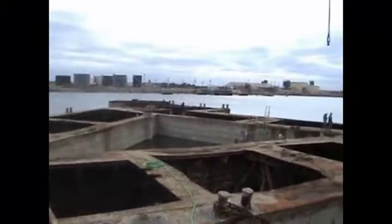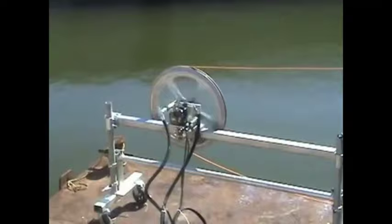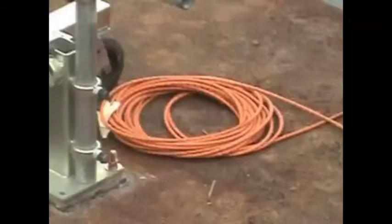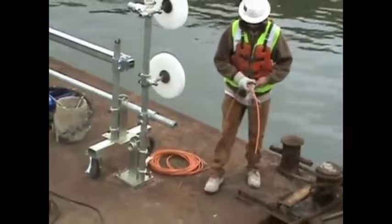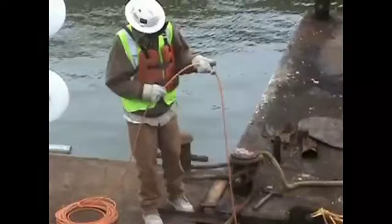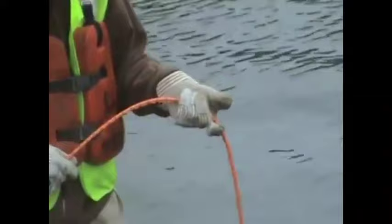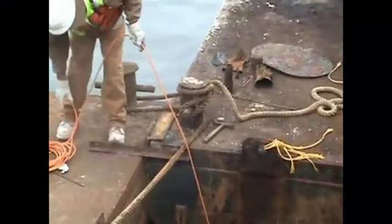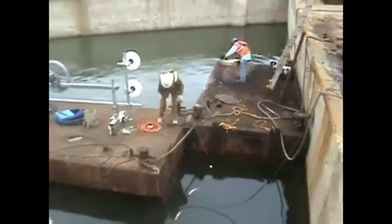A wire saw is a retracting saw that pulls wire in a continuous pull as it spins. We have steel wire that has been specially made to cut steel, only steel. One foot of wire will get you one square foot of cutting surface. The wire we ran is 100 feet, so therefore we had 100 square feet of cutting surface. This wire was designed to last through steel, as other wires wouldn't have.